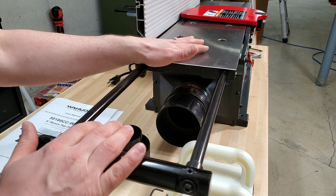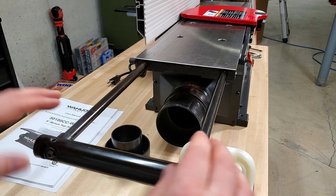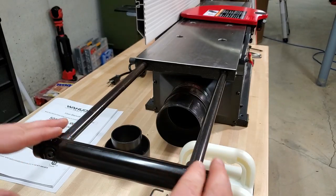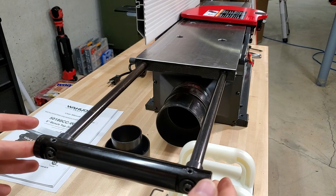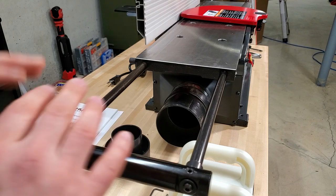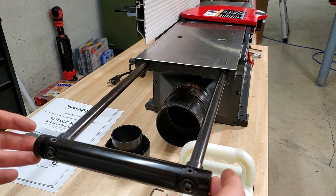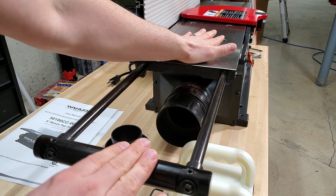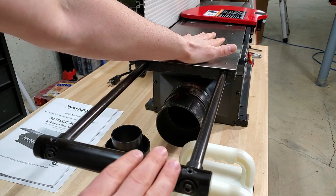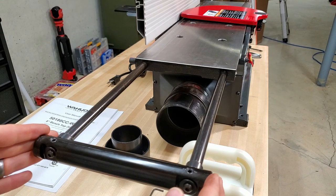The extension wings are steel rods with end adjustments to make them parallel with the table at the same height. You loosen the screws and use cams to adjust the bar up and down. The hard part is keeping it level when you tighten back down — every time I try to tighten, the bar goes out of alignment again. It's nearly impossible to get these perfectly level with the platform. It's better to have them a little low rather than high. These things are just a nightmare to get level because they move when you tighten them down.